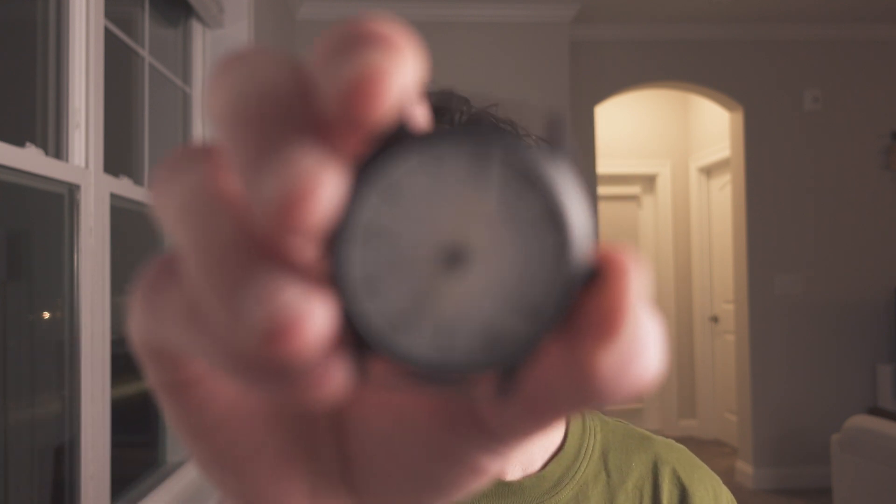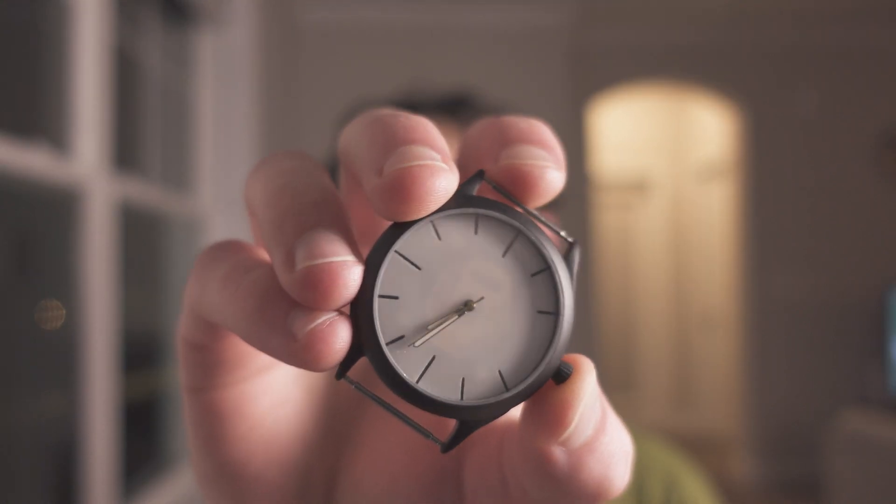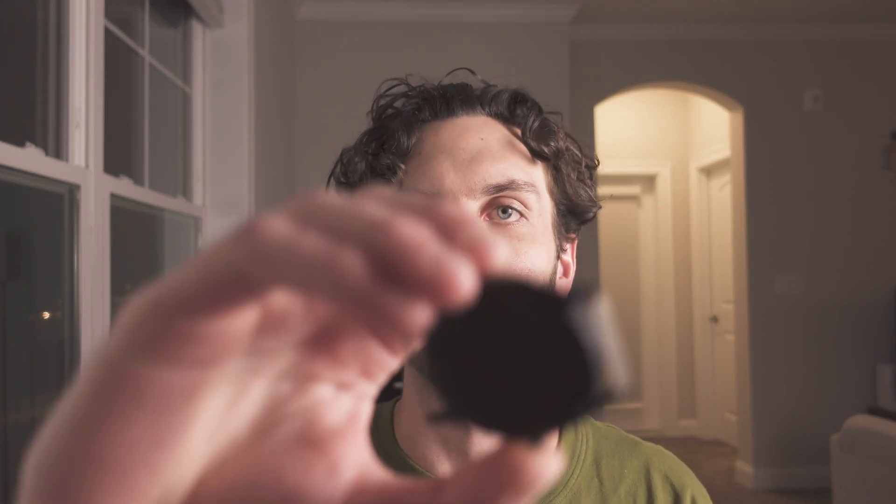It is still a little bit of a DIY, makeshifty looking watch. The dial is 3D printed and sanded. The hands are looking a little bit rusty because I left them in the case for a couple months too long. The case back is still missing that screw. Honestly, this is the first actual CNC prototype I've gotten from this entire project. I'm really happy with how it's turned out. This is a plastic ABS CNC case — I could go for a 316 stainless steel case, which is most common for metal watches. It would feel heavier and more premium, but that costs more money and I don't want to do that right now.